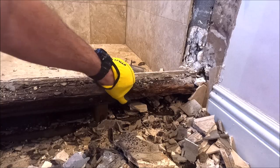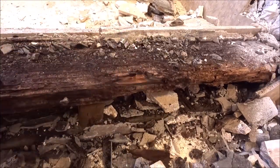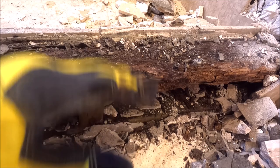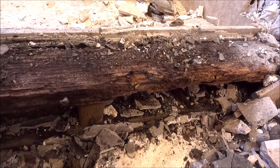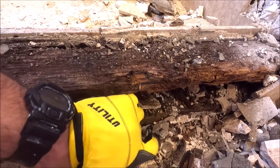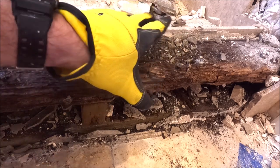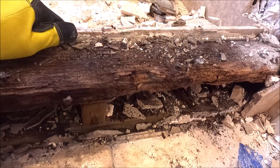As you can see, the wood is rotted out here. Zero waterproofing. It looks like we have quarter-inch Hardie backer on top of the curb with no waterproofing. I have a feeling this failure is simply zero waterproofing — no RedGuard, no AquaDefense on the curb, which is one of the most vulnerable parts of a shower. I'm curious to see what's underneath the shower pan — let's open her up.